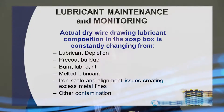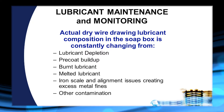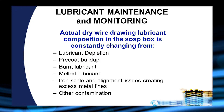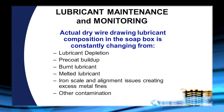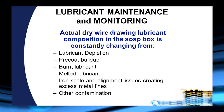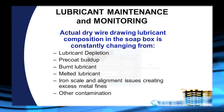Other times we have melted lubricant coming back into the soapbox. In mechanical de-scaling applications, if the cleaning is not complete, scale dust can start accumulating in the soapbox, which will cause scratching and higher die wear. There are also numerous other contaminations that can find their way into the soapbox.